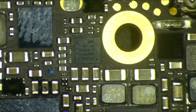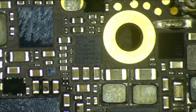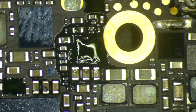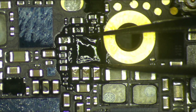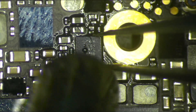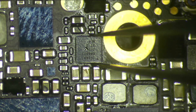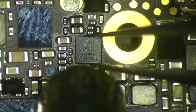First thing I do, just so the flux gets on here nice and easy, I give it a quick preheat — nothing too major. Then I come in with my flux. We don't have to be too accurate; we can just put it on the sides and it will slowly melt down there. Then I come in with some nice tweezers and plant them on the chip. We're going to come in with the heat. I put a little torque on the chip so I can feel it move. Once I see it move, I know the solder's liquefied. A little bit of torque, just like this — the tiniest bit. Once it's liquefied, the chip will move and we can pop it off.